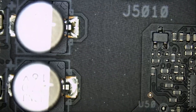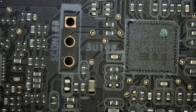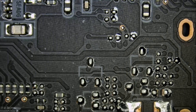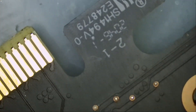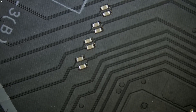I did not want to record a video on this card because I'm still not able to figure it out. But then I discovered something and I thought, let me hit the record button — maybe we can figure it out together. The first thing I did was a visual inspection. I inspected every part of the board for broken, lost, knocked-off, discolored, or blown components or capacitors, missing data lines, and cracked board. I did not find anything. The board looks absolutely mint, not even dust on it.